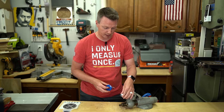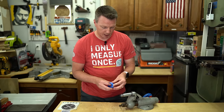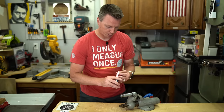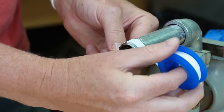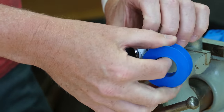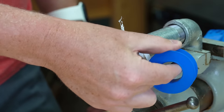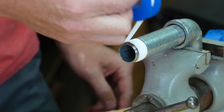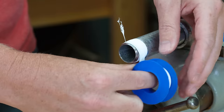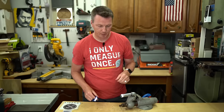The easiest way to apply this and put that pressure on is to use your index finger. Remember, you're holding the back or the top of it against the threads. Apply some right on top, put your finger in there, and start wrapping. After that first wrap, let go and finish the job — that allows you to apply even pressure, give it a nice tight snug the whole time, and get the Teflon tape right into those threads where we need it. Snap it off, follow through, and you're good.